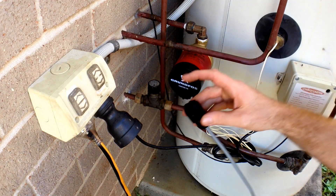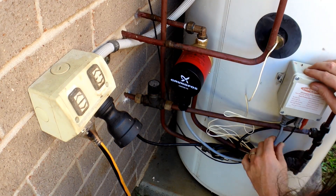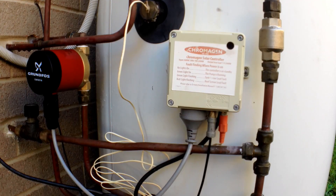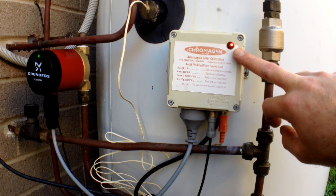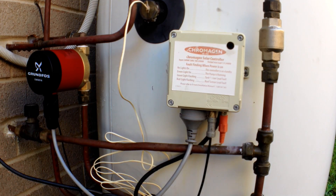So we're going to plug the wiring loom in now. I'll put a bit of dielectric grease on the terminals of the connector because the pump is obviously in the elements — I don't want the terminals to corrode. Plug it into our Chromagen box. Now we can just turn the Chromagen box on here, but before I do I'm just going to put into view the light window so we can see what's happening. Let's flick it on and see what happens — we're watching here for lights and we're also going to watch the operation light on the pump. We've got the initial red power light and a green pulse for the pump, and we also saw the operation light just wink on. So now we'll just leave it turned on — when the heater warms up in the glass box on the roof our pump should start running. Let's leave it and find out if it does.